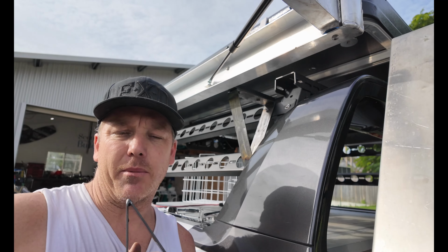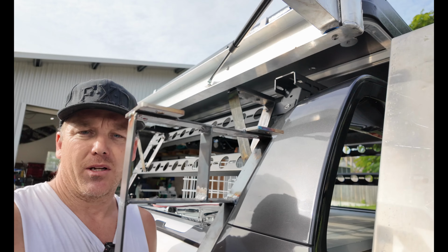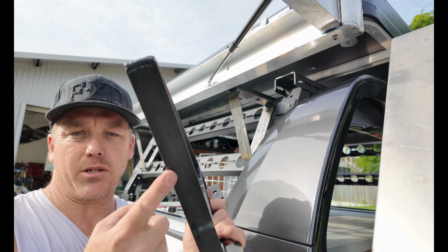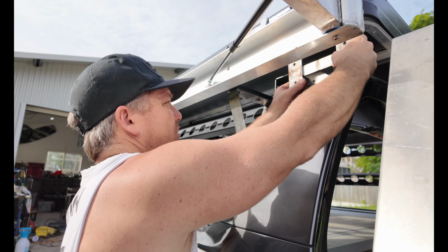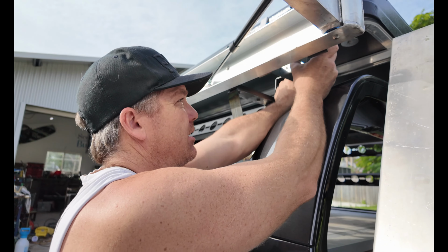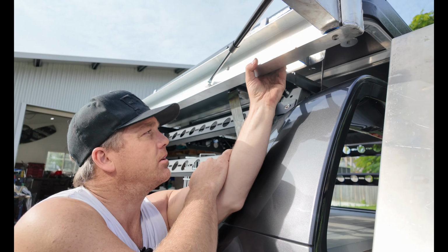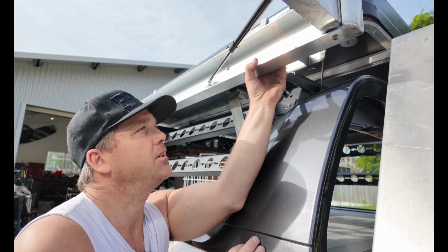So I've made the bracket, I did it off camera, just, you know, I've made the other two, so it wasn't really any point. So that's what I've done. So it's quite beefy, nice and strong, so that'll stop any rocking movement. So I just have to drill some holes in it, but hopefully you can see this goes up, mounted up under here. So it'll bolt onto the rack, and then those plates will bolt onto this, so that should stop any rocking movement. So what I'll do is I'll mark those, I'll mark these other holes, drill them on, drill them off, and then we can bolt that on and see if this really stiffens it up.